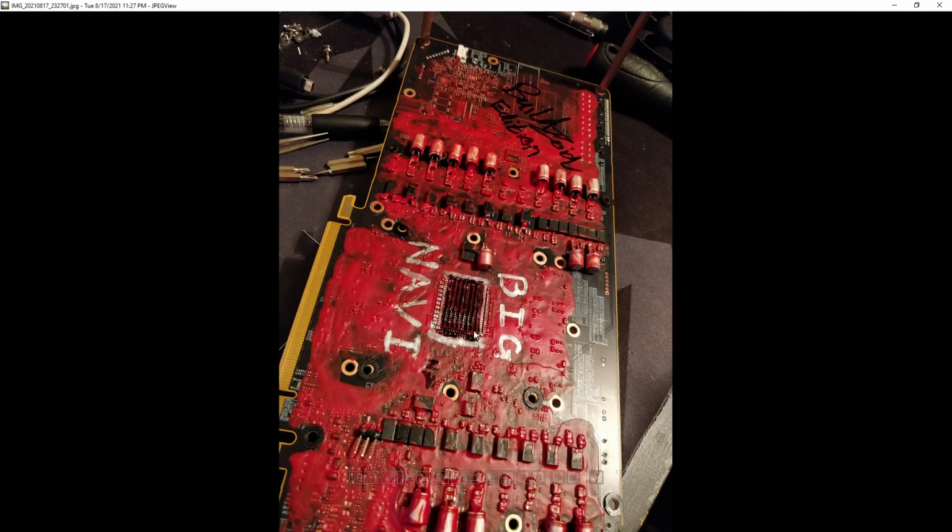So anyway, yeah, I fully insulated the card. This is the kind of insulation I run for hours. You can get hours of runtime on this kind of insulation. And I spent a very long time cleaning the card and making absolutely certain, because the one issue I've run into with plastidip on GPUs specifically is sometimes you get cards that have silicone, or basically any oils, which will potentially make Plastidip unstick itself, which is not great. So in order to deal with that, I really just gave this card the most intense cleaning session ever.